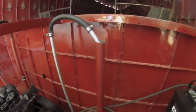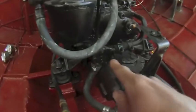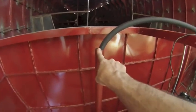Here's the cooling system. This pipe goes all the way down below this level, draws in water, goes through the transmission, through the water pump, all the way through the engine. This is the output, and then it goes back into here and that goes down outside the boat where the water will cool it. And that goes across, through here, and then back outside the boat to this side, which will cool it some more. And then we return.